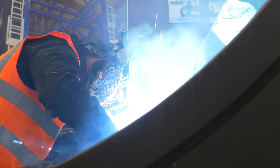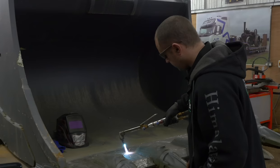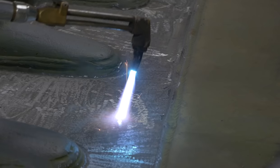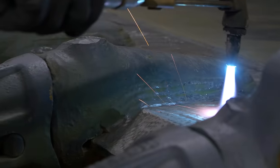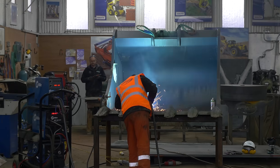What people used to do was weld rebar on, basically just doing solid strips or solid lines of hard facing wire. What's really different with the way we do it is we heat the steel up, temp it, and then put the wire down in loads of different directions so it has more places to wear. When the material goes in — stone, clay or mud — it basically doesn't have a path to follow. It wears the hard facing wire we've put down rather than the blade.